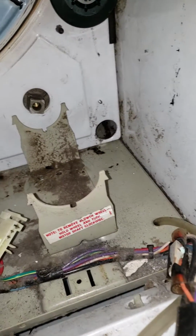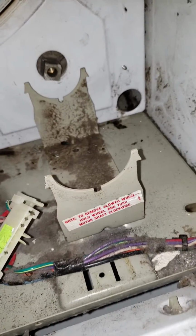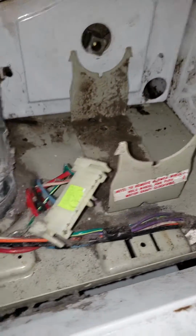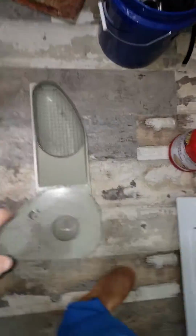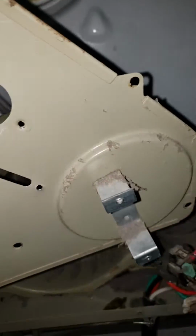So anyway, I assumed I needed a motor and went down to the shop, and the guys at the shop said, no, you don't need a motor. They said the problem is this assembly, the backside blower cover assembly squeaks. So if you look at this, there's seals on here. Of course, this is the inner assembly, let's call it, and this is the outer assembly.